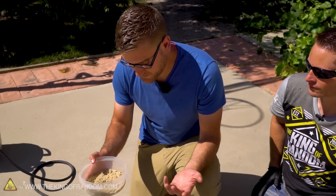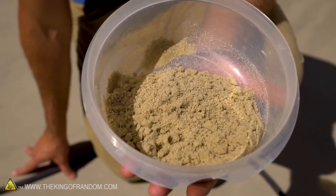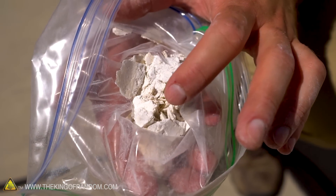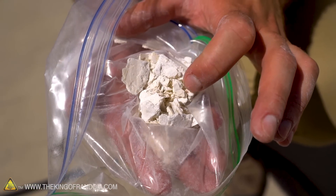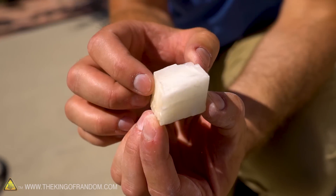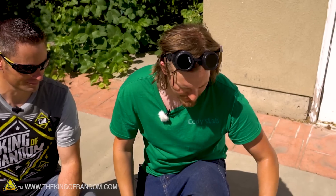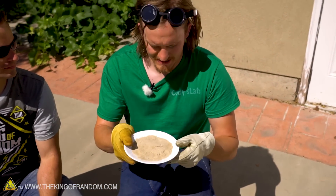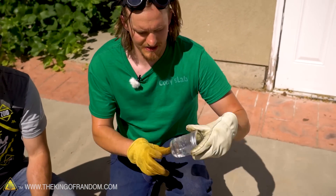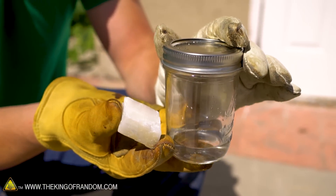I have ingredients from four different states. I have sand collected in Minneapolis, Minnesota; then in Wyoming I collected sodium carbonate and sodium sulfate from a lake; in Arizona I collected gypsum from an old mine; and in Utah Cody helped me find some calcite. My role here is basically the chemistry guy — I helped Andy purify his sodium carbonate, helped purify the sand a little bit, and also sourced the nitric acid which we'll convert into calcium nitrate by reacting with calcite.